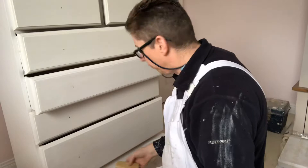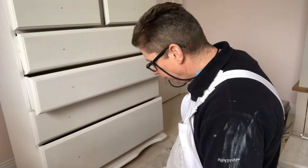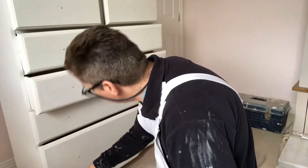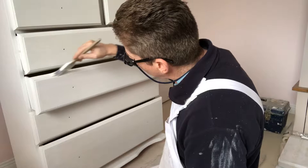What I'm using today is this wee pretty angled brush just for the edges. Basically what you need for doing this is a good quality brush and a wee roller tray. I've got the edges all done inside — these are all done — so just the face of these here to do. Get your wee brush and give these wee edges a finished coat, and try and avoid the paint going down under the back edge — just be careful with that.